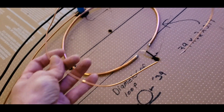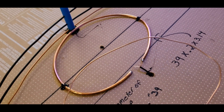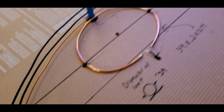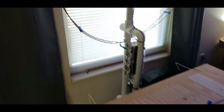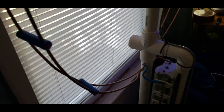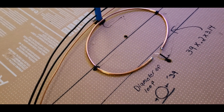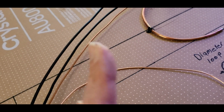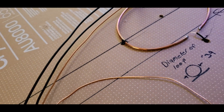The coupling loop doesn't have to be thick wire — you can use the same wire as the antenna. It does make your bandwidth smaller though. The thinner the wire, the more resistance, and loop antennas don't like resistance. The thicker the material you use, the better it works. That's why I used thick heavy-gauge copper on this one.